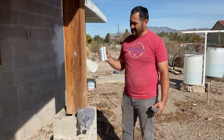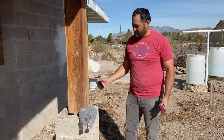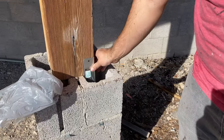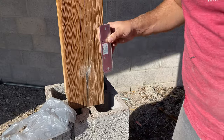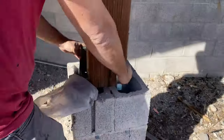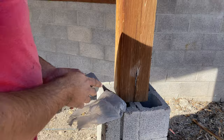Galvanized metal, so the intent is just barely to have something so that this is anchored and it's not going to move. So what I'm going to do is basically put it a little more than half buried in the concrete, and I'm going to run some of the nails at it so when it dries it's fully anchored, and then some nails to the thing, and then just do one in each corner, and that'll keep it from any type of movement.